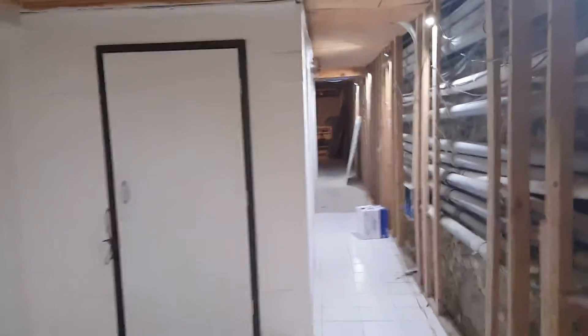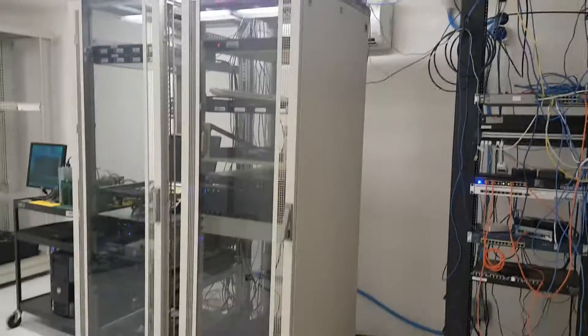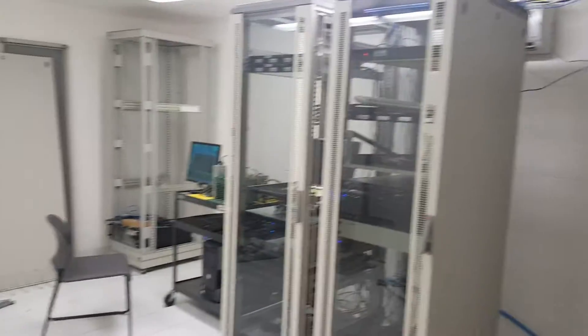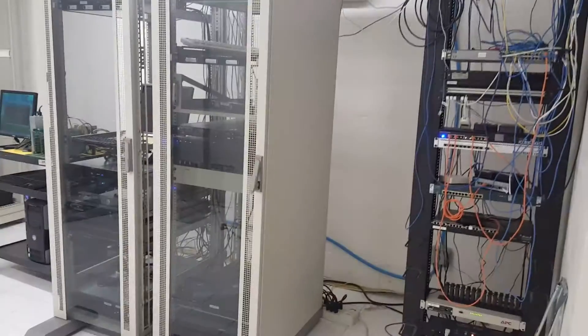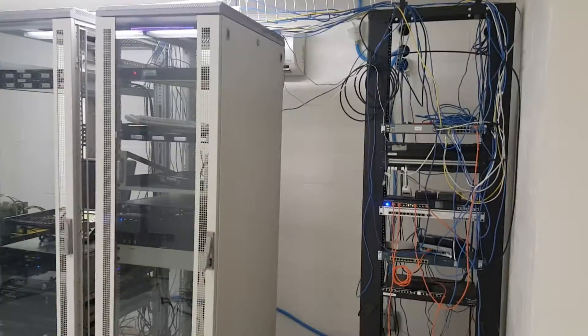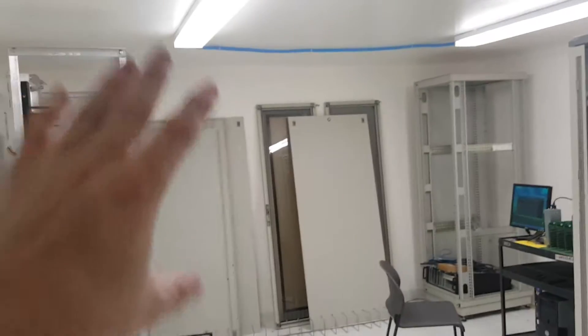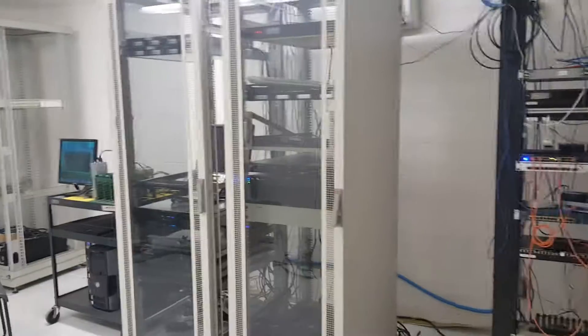All of this piping runs all the way back and then all the way down. If we need to unplug anything or move anything during this changeout, just let the IT department know and we can take the servers down accordingly. Right now we know we need more power in here — there are probably two 20-amp circuits on this side and we'll need at least one or two more for this side.